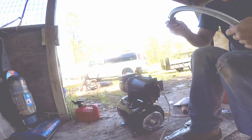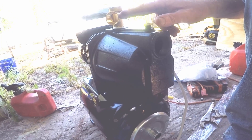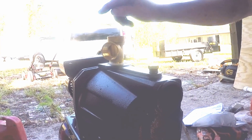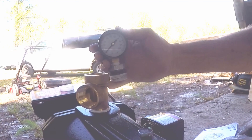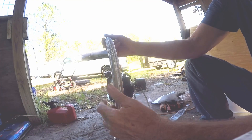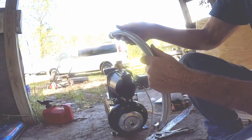We've got to have pressure — this is our pressure hose. This T connects the pressure from the tank down here to the water pressure we're going to receive. Then we put another T on it, so we've got discharge coming out, and we'll also put our pressure gauge on top so we can see what kind of pressure we have. Don't forget to use your pipe thread tape. This fitting doesn't screw directly, so we're going to screw this piece in and hook up the compression fitting that goes onto the air tank.